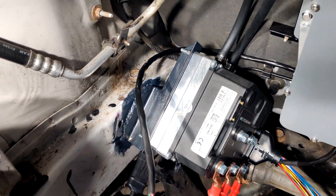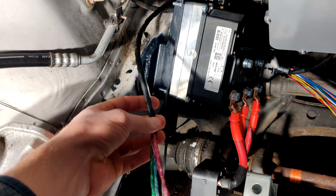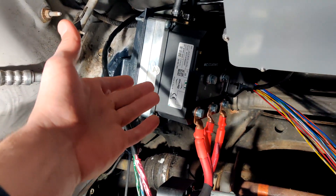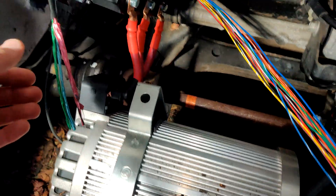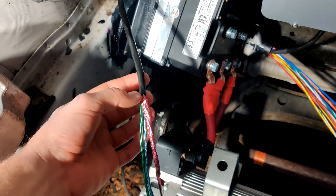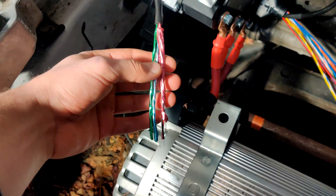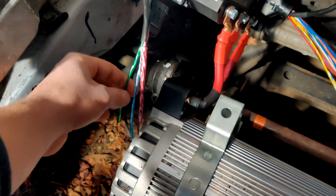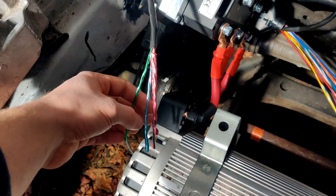What you want to do next is trim off any excess length. This sheath section comes with six feet of wire, and most of the time your inverter is only a foot or less from the motor, so you can cut off the excess. Then you want to remove the sheathing about four inches from the end where you cut it to expose the foil, because these wires are not all going to the same place — one goes to the thermistor and two go to the encoder.